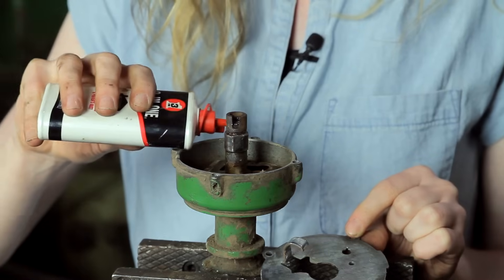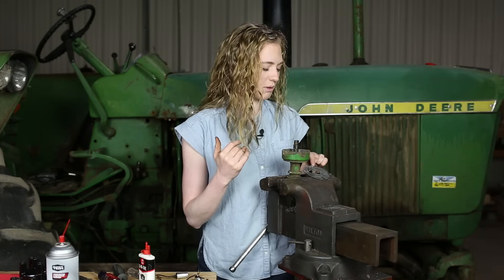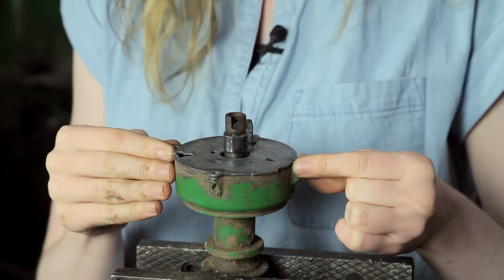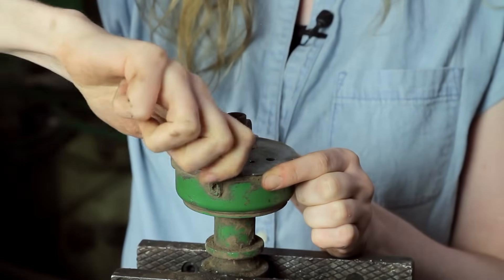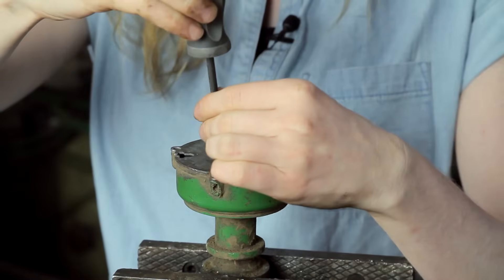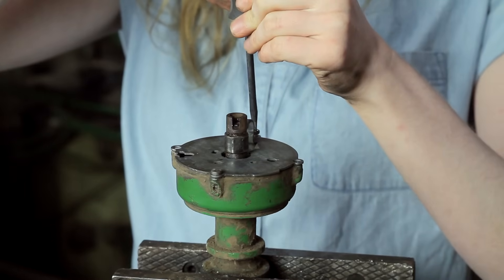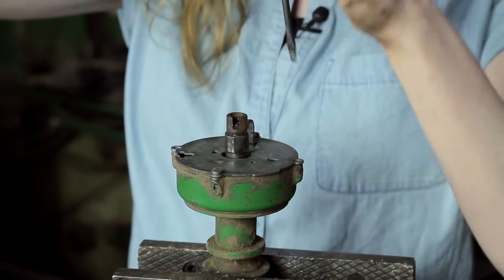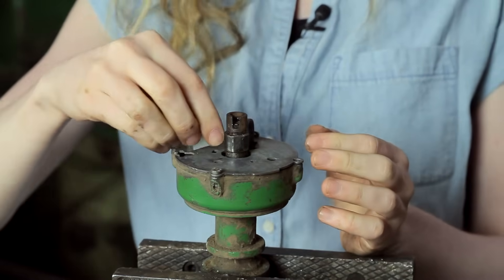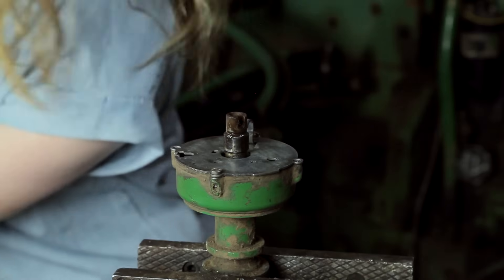I put one or two drops on each side of my spring and slide here in my distributor. I'm using the three-in-one oil and that's what you can drop in there before you put your plate back on. You can see that my plate is all cleaned up on both sides. I don't want to have any corrosion on the plate as this is the way that the distributor is grounded. With that done I'm ready to put these screws on each side so that my plate is held into place. This plate is directional — if you get mixed up on the direction just look for the notch on the side where the wire comes out of the distributor to the coil and you'll be able to line that up and get it in the right position. I'm going to make sure these are really tight, and with that I'm ready to put a little bit of grease on the top here — this comes in your tune-up kit.